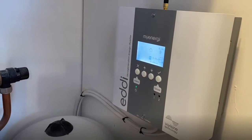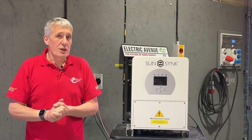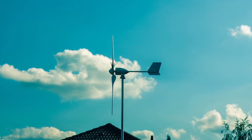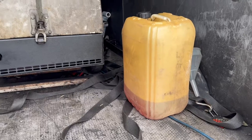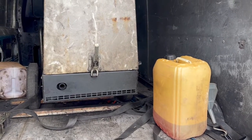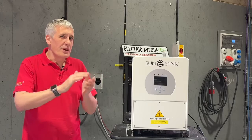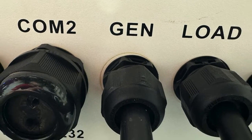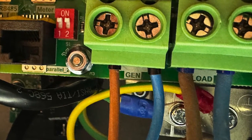Although labelled as an auxiliary load, its capabilities go beyond just handling loads. You could utilise the terminals for inputs from micro inverters, wind turbines, or even diesel generators — if you know why that could be useful, share your experience in the comments. Due to this flexibility, the auxiliary output is also sometimes referred to as a generator input within the inverter instructions or on the circuit board, so things can get a little confusing.